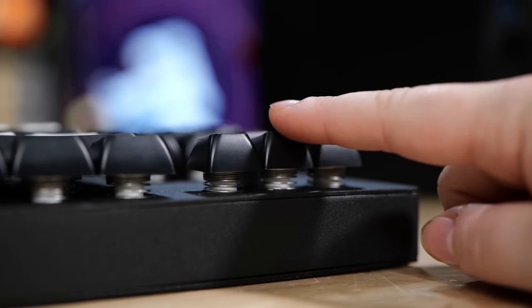I put the USB Type-B connection in this keyboard the way that it was originally designed. This is a USB Type-B connector. This is enormous compared to a USB Type-C connector. It is actually a very similar width, but the USB-C connector, of course, is much less tall. So it'll be a little more forgiving, ironically, for a top-to-bottom flex than a side-to-side flex. It's stronger side-to-side, it's weaker top-to-bottom, but side-to-side, it's probably going to rip off the PCB. This Type-B connection, see the keyboard, and see that it's really, really far back in there.